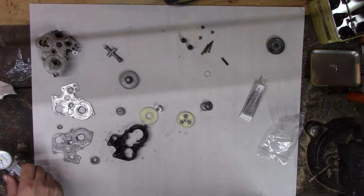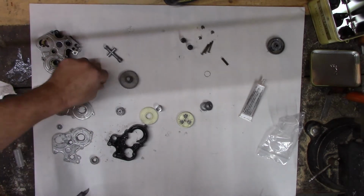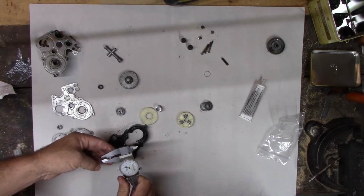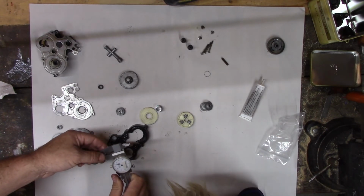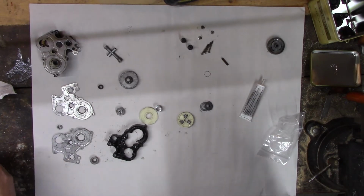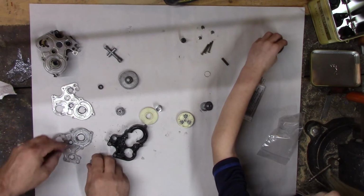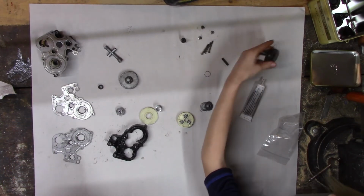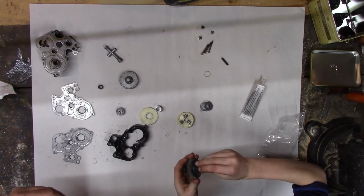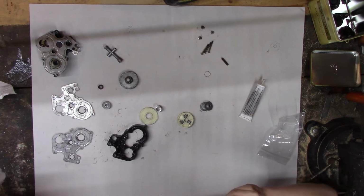We have other bearings we can compare it with. We have a bushing. We have these new bearings. Same size, right? Alright, so the bearings are the right size. Unless it's missing a bushing in there or something, then it should be the right size. So it's not the bearing. Good idea to get cleaned out anyway, though, right? It's pretty filthy in there. So we'll put the bearing back in. So that'll work. Not the wrong size bearing.